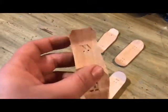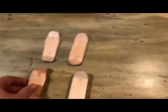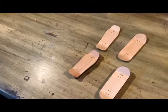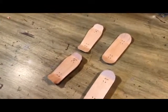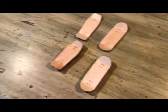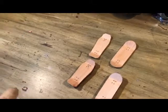But that was no problem, but this one actually gave me a lot of issue, because there's so much material being taken away from the normal shape because of the small cruiser that I actually found the material almost going around the bit because of how much excess there was. So that's one of the biggest reasons why I don't personally recommend doing the full rectangle version for smaller boards or cruisers or stuff like that, because it's just easier if you have access to the machine to cut the extra material off.